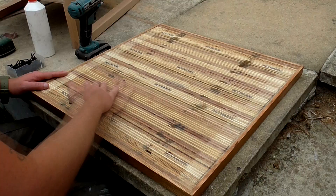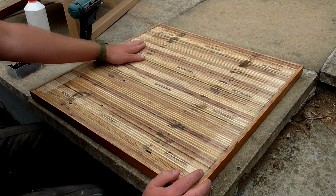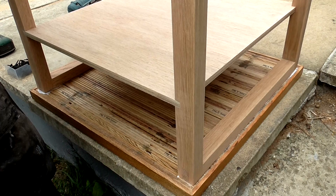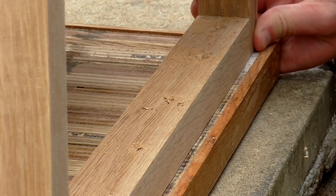I've got the tabletop face down now and I'm about to add the table frame. I used the electric file to sand off where the legs will be glued to make sure the glue sticks properly. I used wood glue, then drilled some holes with a 2mm bit, countersunk all the holes with a countersink bit, and secured the frame to the tabletop using some drywall screws.